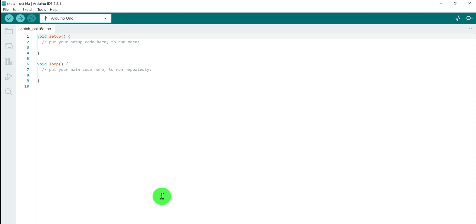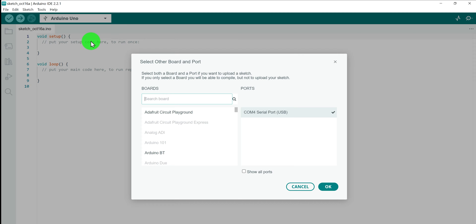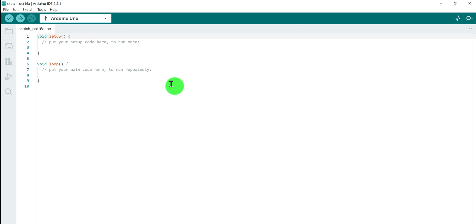You're going to have to select your particular Arduino. So I'll plug the USB in — there we go. If it doesn't come up automatically, you'll have to select it manually. It tells me the Arduino is on COM4. And we're basically now ready to program. But for those who haven't managed to get their Arduino yet, there are simulators — let's have a look at that now.